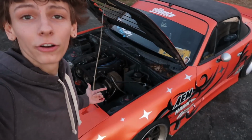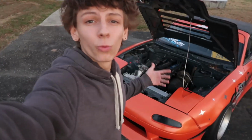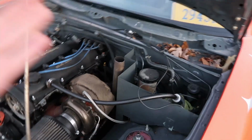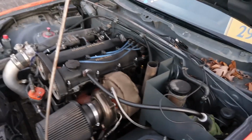Since I do have it on the underside of the cylinder number 3 runner, it does have a little bit of boost creep because it's not the best wastegate position. But it's good enough, especially for a lower-ish power setup like this. I get 1 to 2 pounds of boost creep, and that's really it. But otherwise, it's worked great, and I've been very, very happy with it. One thing with having your external gate out the hood is that when it does rain, you do have to cover it, otherwise you'll lock up your wastegate.